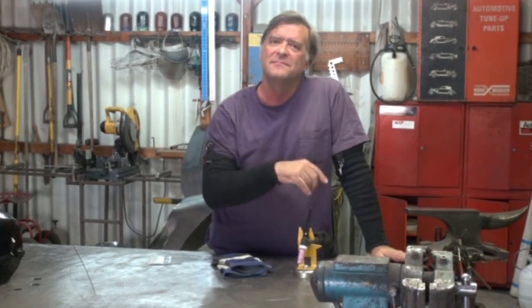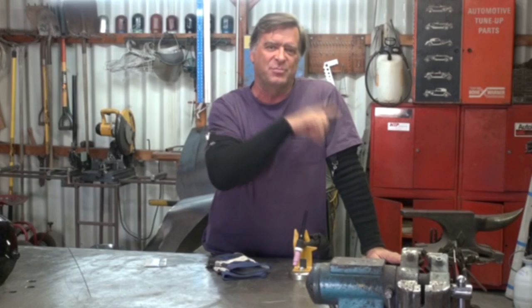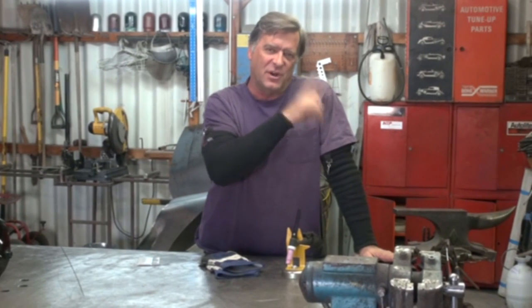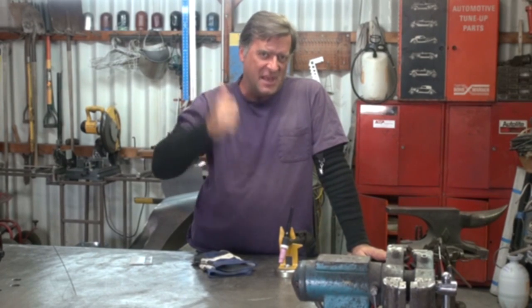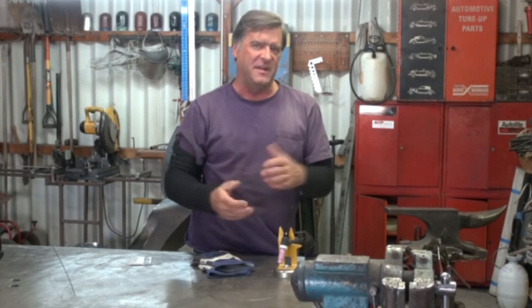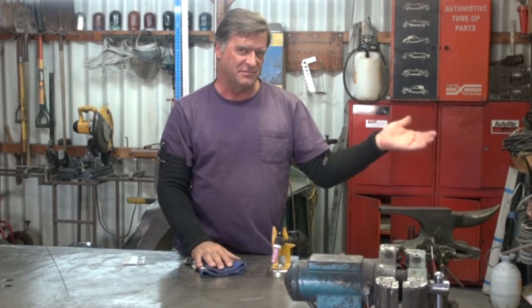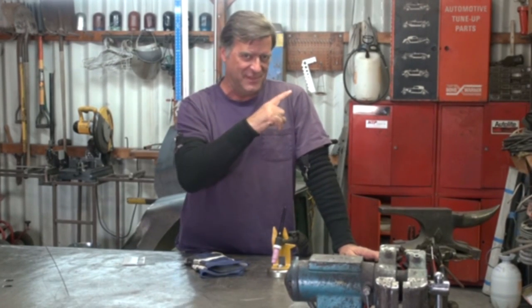Is that the inverters over the transformers that are noisier? Well, that's part of it. It's just that they're putting such — they're going to bigger fans, to shove them inside those little cases trying to get the duty cycle up on the machine. And of course a bigger fan, a stronger fan, a fan that runs all the time rather than one that's only on a thermostat that only runs when it needs to, like on the older transformer machines. So the minute you flip the switch, you got the fan.